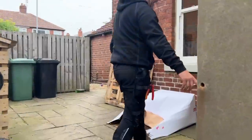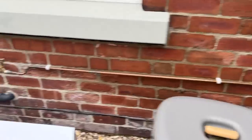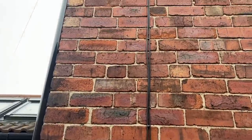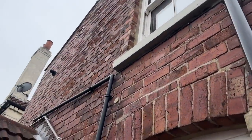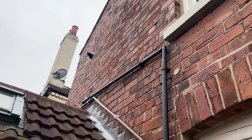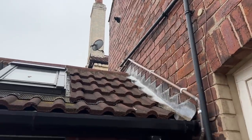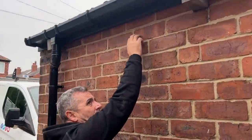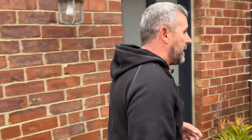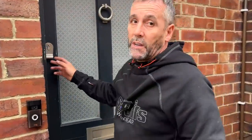The cat six comes back out of the cellar - it's exterior grade, tacked along there, following that coaxial cable. We go around the front of the building, tacked along there, over the top of the outhouse roof, drops down the other side, and comes along entering the room just behind the kitchen unit. We're going in now and John is going to terminate the cables and show you how he terminates them and what he uses.